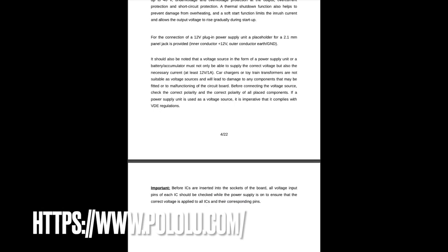Then you have a power supply, which is 12 volts. And there's a drop-down regulator, or step-down regulator, on the board, which takes this down to 5 volts. But in some instances, like the SID chip, you may have to up the voltage to 9 or 12 volts again. So you have to add a step-up converter. These Pololu step-down converters I had to order from Pololu directly, which took some time. And Matthias says that you should test the board's voltages before you put in any ICs, which makes total sense because these ICs are the most expensive part of the whole project.